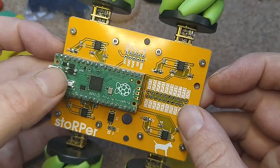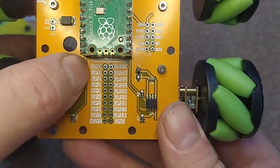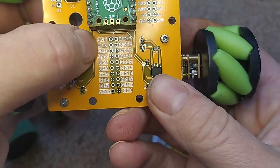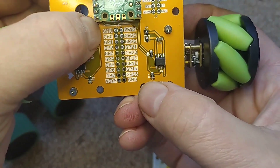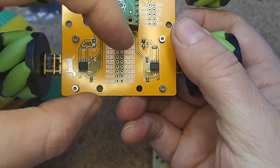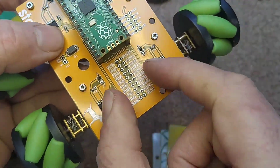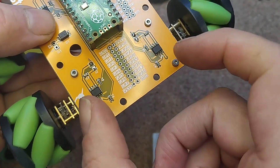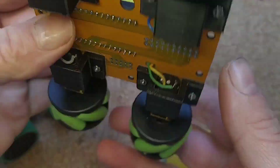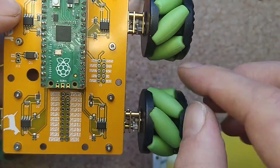You can also drive it with a little USB pack. All the pins are broken out into two panels — all pins broken out, with a few more left over. I've done a clever thing where the ground and VSYS power are laid out so that if you made an adapter and put it in the wrong way, you won't short it out — it's reversible. The idea is we can make little mini hats with sensors that could be mounted above or below.